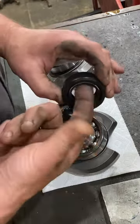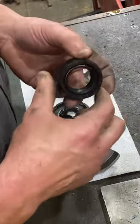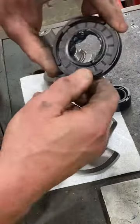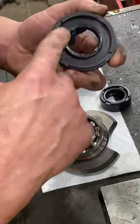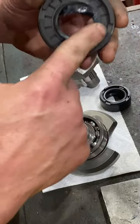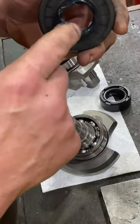The void in the middle — the proper way to install these is to pack them with a heavy grease. Any wheel-bearing grease will do, and that's how this one's prepared. I used, in this case, a new tube of John Deere heavy-duty grease, and I figured the green color would be appropriate.